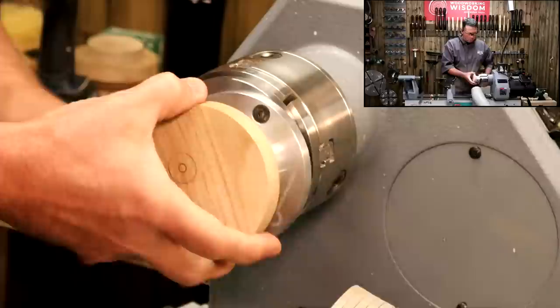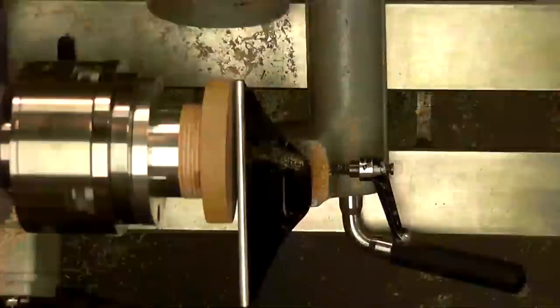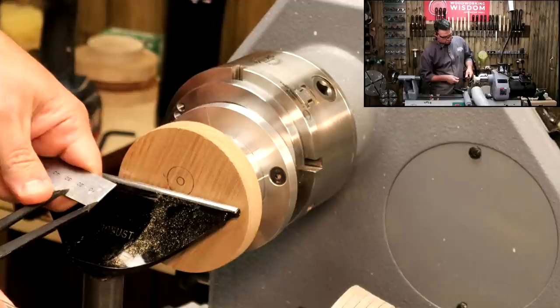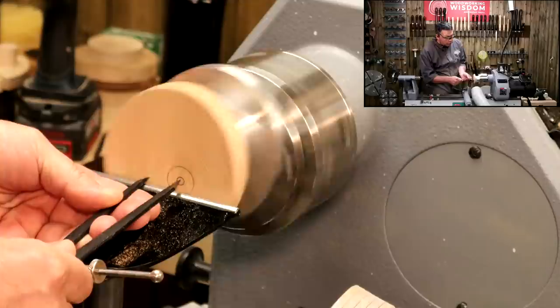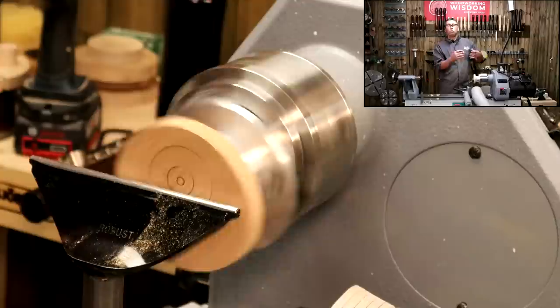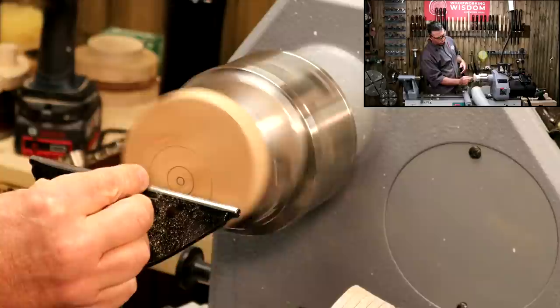We're going to use one of the larger pieces — a bit of brown oak. I've measured it already and we're at 46mm, so I've got a set of dividers here. Half of 46 is 23, so we're going to pop one side of the divider over the center point and just roughly scribe the outer ring, marking the diameter we're creating. I've got lots of little billets back here so if I make a mistake and go too big, I can put another one in. Start a little bit inward of your line and slowly creep out as you refine the shape.